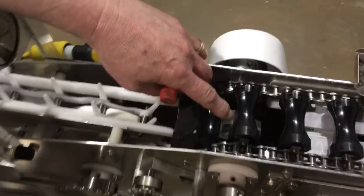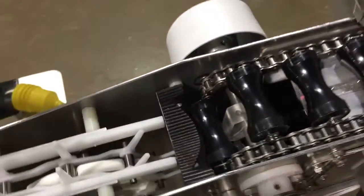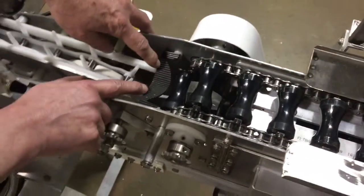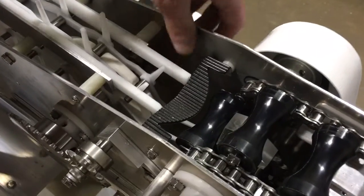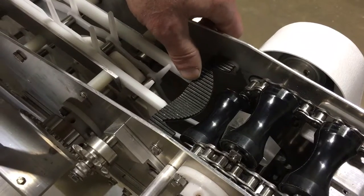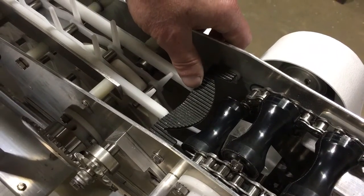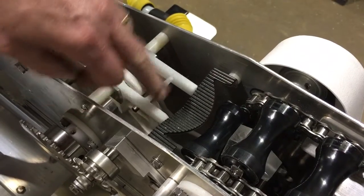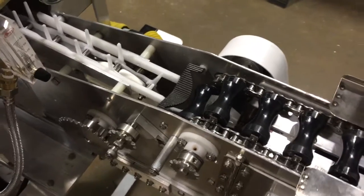As you can see, this one is already nearly touching the spool behind it, so it's in the proper position. As far as our aluminum transfer, it should be in a slight downhill slope in the direction of egg travel. It should be flush with, or slightly above, the white plastic lead-in rails so that the egg rolls smoothly across there.